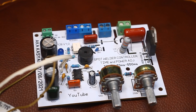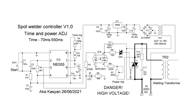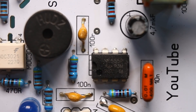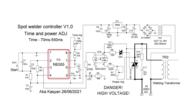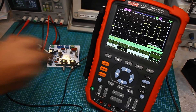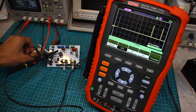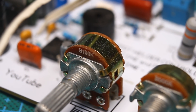Control board — I already shot a video about its operation; the link is in the description. I developed this circuit a long time ago and in my opinion it is quite good and has many advantages. Firstly, it is completely analog — no microcontrollers. The well-known NE555 timer is responsible for control. By pressing the button, the timer generates a single pulse of a certain duration or time, which is set by a variable resistor. This resistor determines the welding time, which can be in the range of 50 to 550–570 ms.